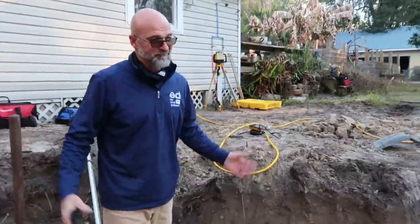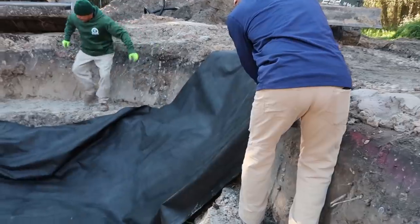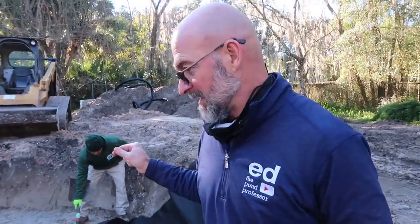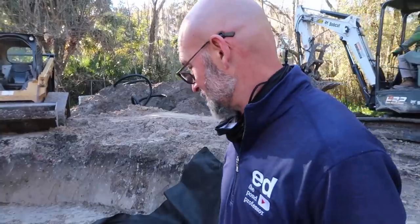Fabric is going in, then we'll get our four-inch drain tile on top of that. We're going to put in some clear stone and literally push the pipe down to the appropriate elevation - as we push, water is going to start seeping in and displace some of the mud. The big challenge is the more we dig it's just going to keep collapsing. We're a little deeper than we need to be, but we'll start manipulating everything. That's the slumping right there.